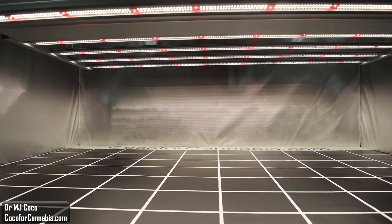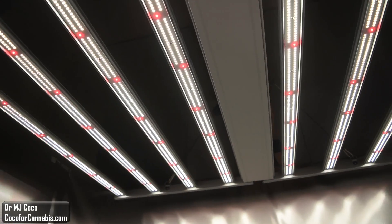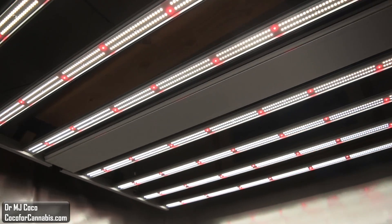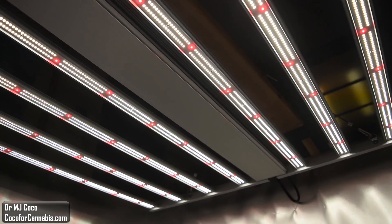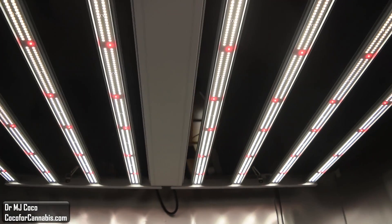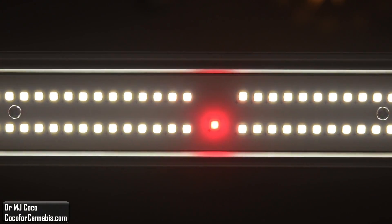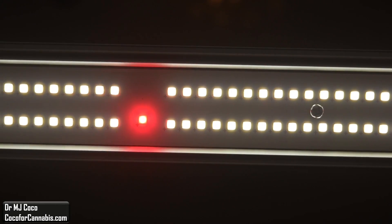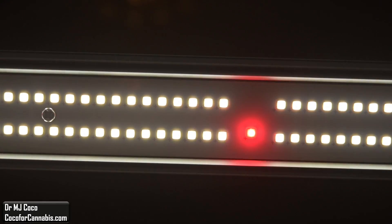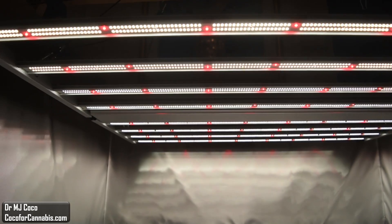Let's take a look at the diodes. There are a total of 2,800 Samsung LM301Z Plus diodes. They're not quite as efficient as the LM301B or H diodes, but they're still top quality, and 2,800 is a really decent number. In addition, there are 64 OSRAM 660nm diodes — you can see their red glow. I inspected the diodes to ensure that they are authentic. They check out. The diodes do not help us solve the mystery about why this fixture is so affordable.